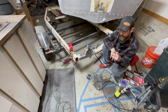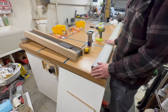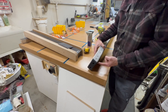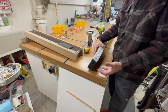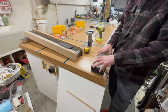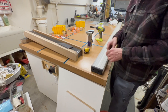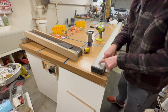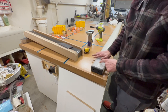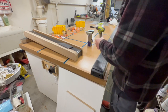Here's the bunk from last week's video. It's a Gatorback cover over a cedar rough-sawn piece of wood — rough-sawn meaning it went through the first stages of milling but not all the smoothing phases, so it's a bit rougher but retains more of those waterproof qualities. Underneath, we have a channel cut into the wood with an LED strip so that when we launch or land this boat at night, we have a lit runway to bring the boat onto. Now we know some measurements we can work with for mounting.